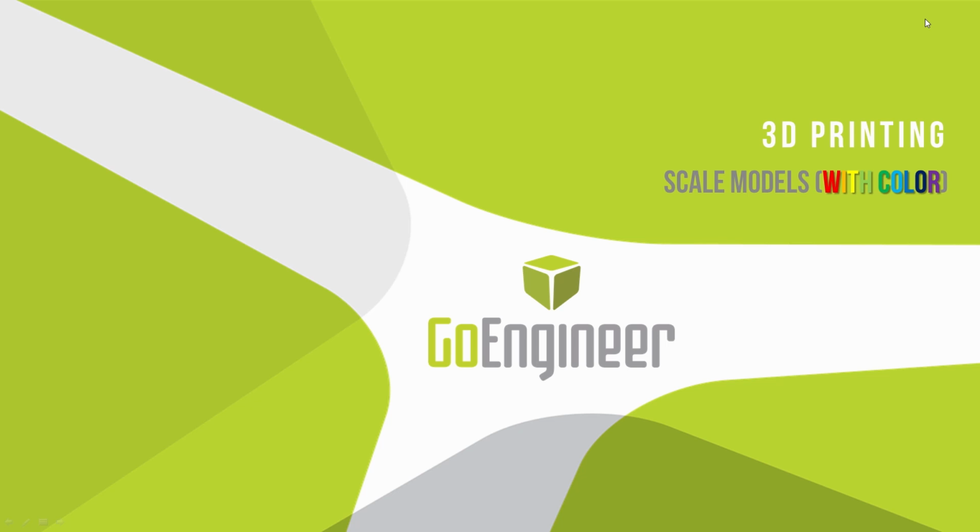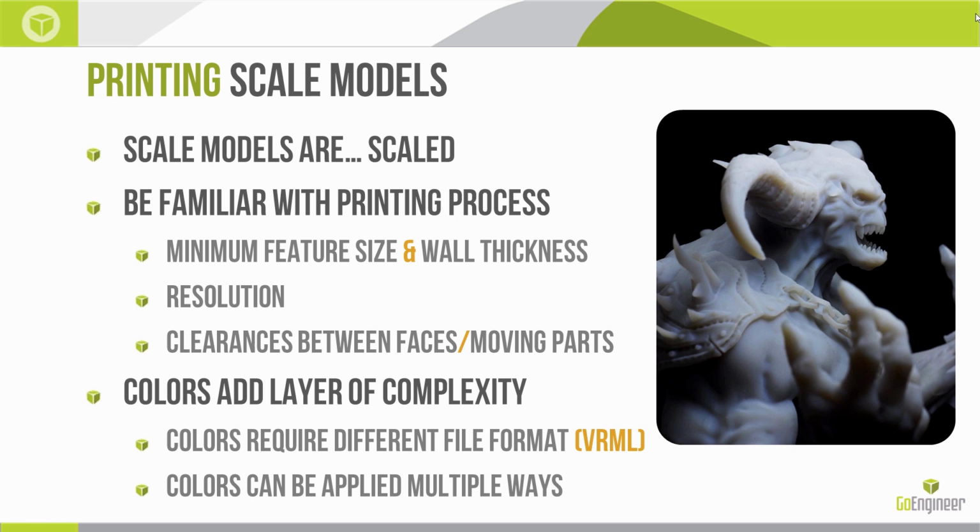And today I'm going to be talking about printing scale models with color. So printing scale models, what does it mean? Well, essentially I wanted to do a webinar topic about scaling models up or scaling models down in anticipation for 3D printing. So we're talking about parts that are printed at a different size than they normally would be designed and some of the challenges that come with that. Also, because we're now printing with color with the Stratasys J750, we've got full color capabilities. That becomes popular when we start talking about figurines or scale models that are being used for appearance purposes.